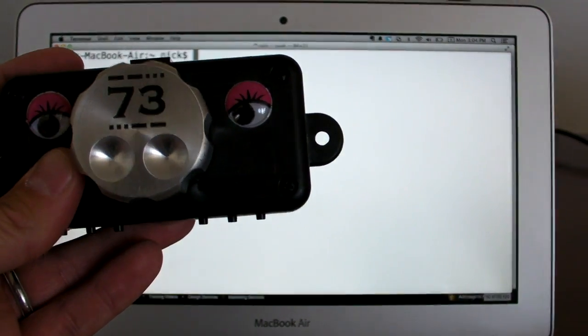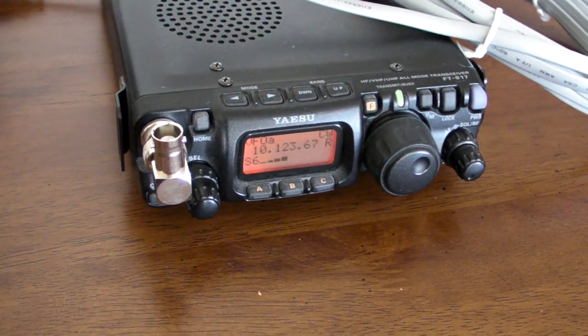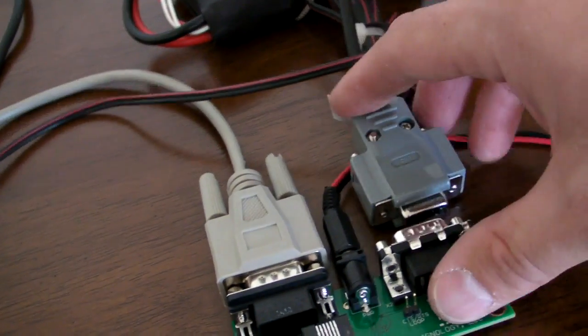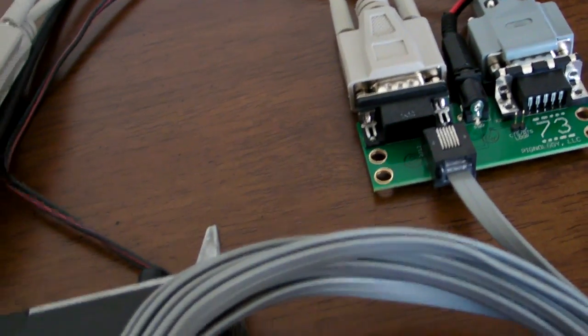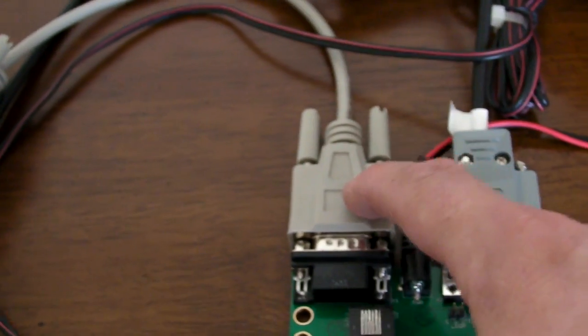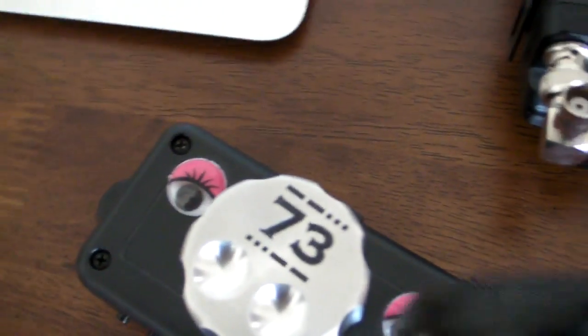So I decided to give it a shot and see what I can do. Here we have the 817 — this is my 12-year-old FT-817, still going strong. Back here is the little satellite interface board. I'm using the CT62 cable to connect to the radio. This would sit behind your desk with a cable that runs up into that connector, which sends power as well as two serial ports — one going to the computer, one going to the radio. It'll proxy data through, and when you spin the knob on the encoder it'll send the command.